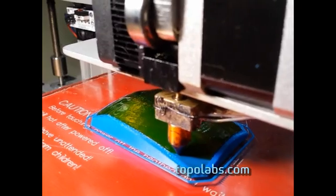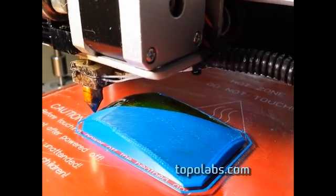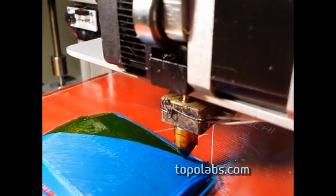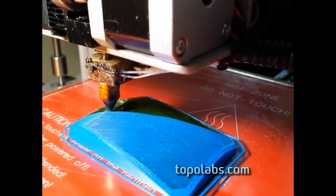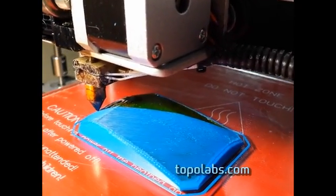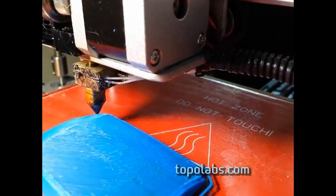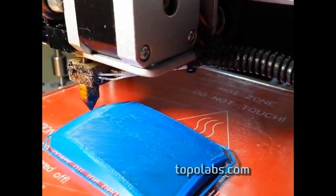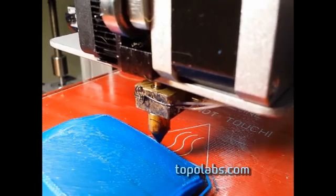What that does is it keeps the material that we're adding to the top from sticking to the support material, but it does stick to the outside layers. So what you see here is the system actually moving in all three directions at once — notice the Z axis going while the X and Y axes are going, laying down material along three-dimensional paths. There it goes up and over the curve. After completing the first layer, it goes around and creates some perimeters, also done in 3D.